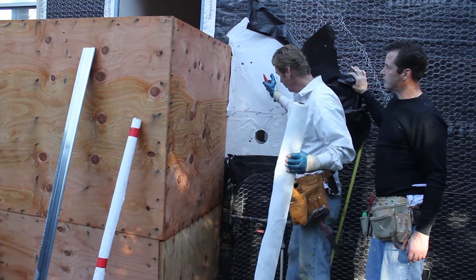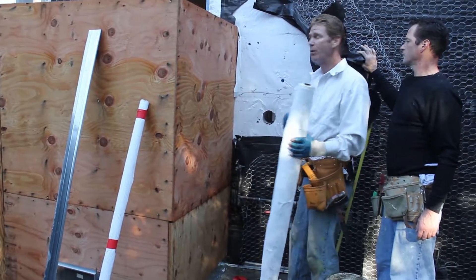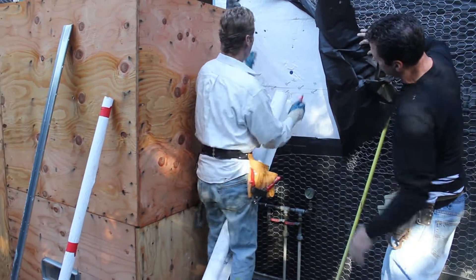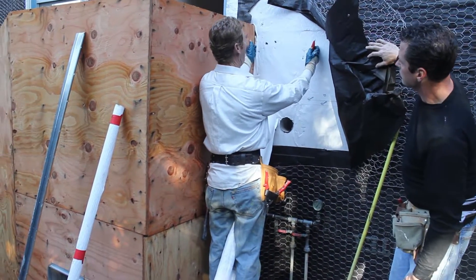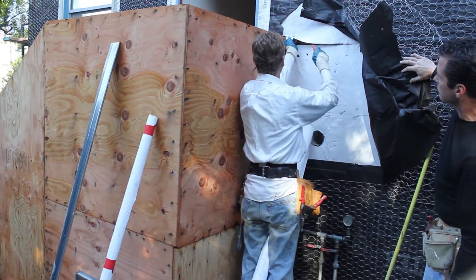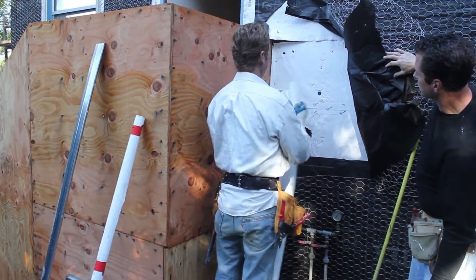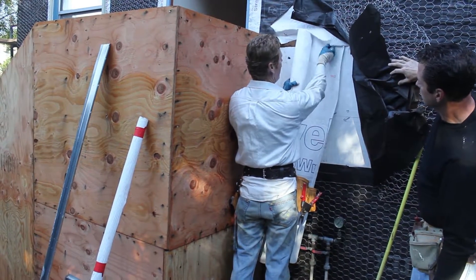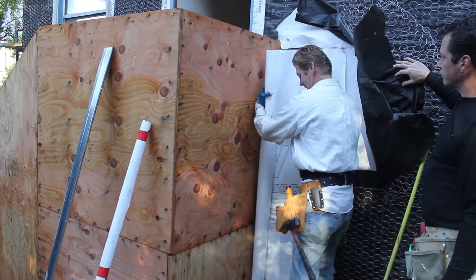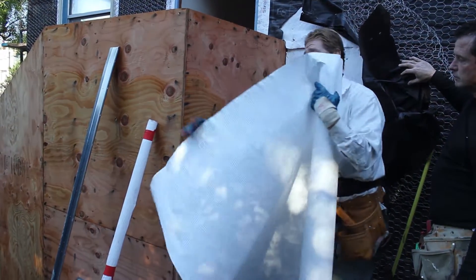It was time-consuming enough just to take this off, and we still got to take off that black paper and pull this back. Now we have a wall that had the original Tyvek underneath. I like to go at least a foot and a half over my vertical, so I'm going to take this knife, cut it right there about a foot and a half, lift this up, and after I remove this, this new paper is going to go under this paper. We've got to put this Tyvek tape on this seam, and we go around here. I'll show it to you when we get to the next stage — but that's what we're doing.